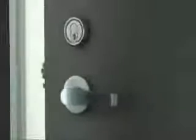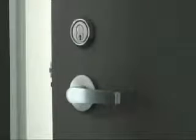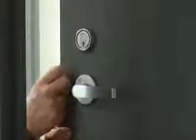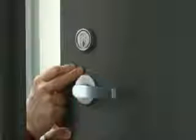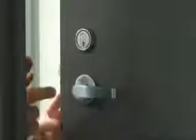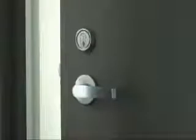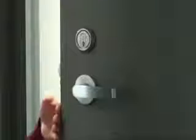The next thing we're going to do is shut the door and make sure that it engages the strike properly. It's also important to understand that when a door is properly hung, we need to check the dead latch mechanism. There's a small tongue underneath the latch, and when we push in on it — as it would be held in by the strike plate — it will lock the latch, protecting against somebody trying to open the door with a credit card. When we close the door, we want to make sure the latch engages properly into the strike plate and that the dead bolt throws properly. There is a normal door gap that we should see all the way around the perimeter of the door.